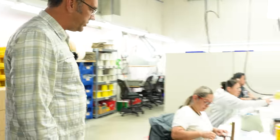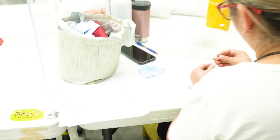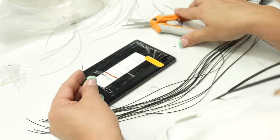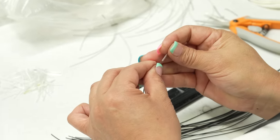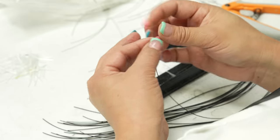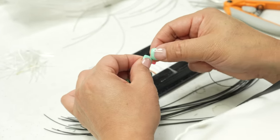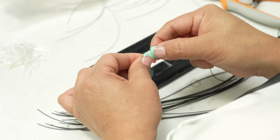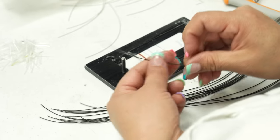And so what she's doing is doubling that line over, and then she's adding a reinforcement sleeve, which, with a welded line, your most vulnerable point is where those two points come together. What we add on our lines is a piece of reinforcement there that keeps that from coming up. We've always done that with spey lines and saltwater lines, and then about 2 years ago, we started doing that with trout lines as well. Any line that's a premier level or above gets that extra sleeve, and it pretty much makes them bulletproof at that point.